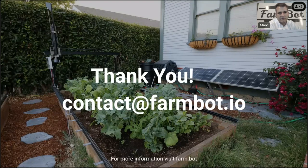There are some minor adjustments that will need to be done. So if you're in an area that has considerable sunlight, or if it's really hot, you may need to adjust the tracks, because over time, due to thermal expansion and contraction, the tracks can shift, and you can get one track that might go just a little bit out of alignment. That's like 5 or 10 minutes once or twice a month. But basically that's it.